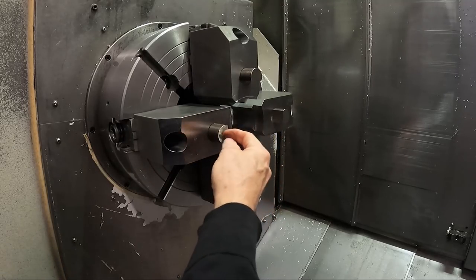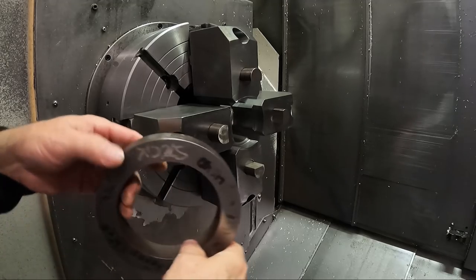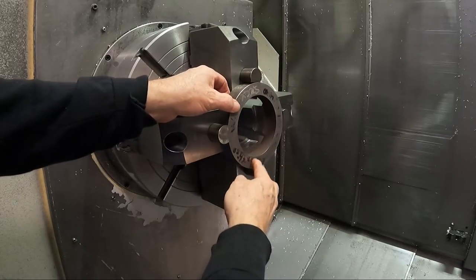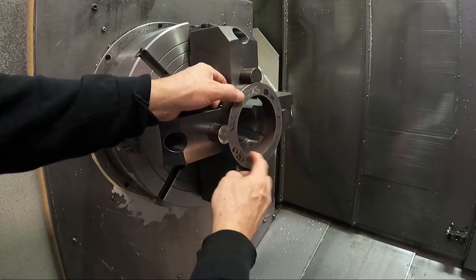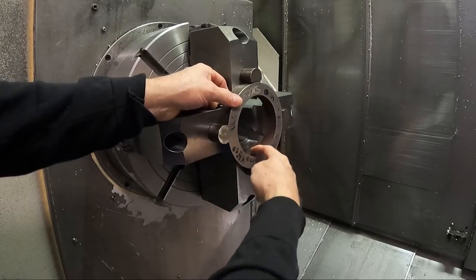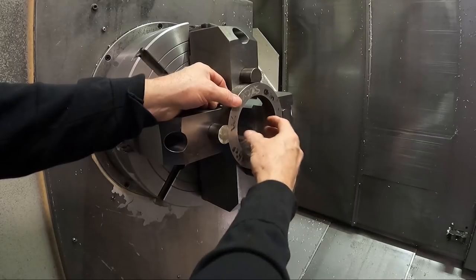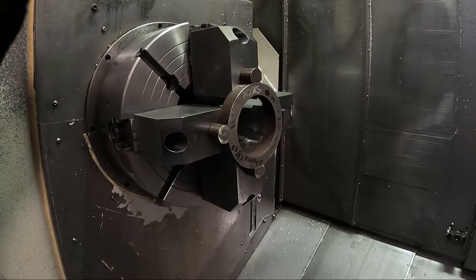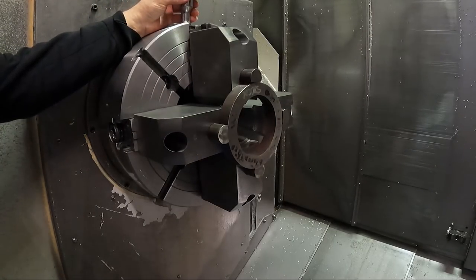You can have different pins with different offsets on these. What I usually use is just a piece of saw-cut pipe, heavy wall pipe, to hold this ring. The bore in this pipe is a little bit larger than the bore I'm boring in the jaws, so I put some tension on the jaws like this. It's just one way I do this.